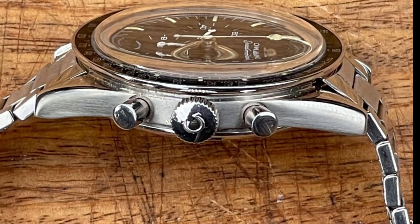Here we've got the same finish again — service pusher, service crown. You can tell that from the round Omega symbol. Badly fitting end link — big red alert there. And look at that: all that sort of nibbling case cancer dirt. That's not dirt — that's corrosion.